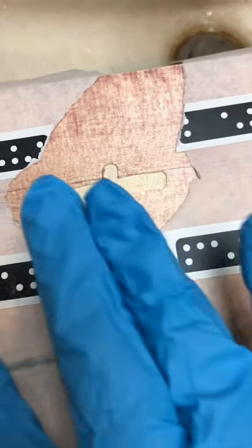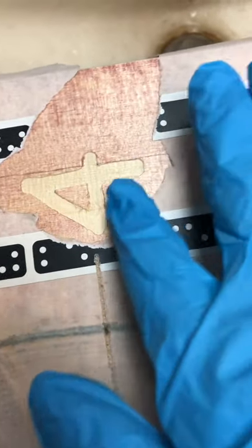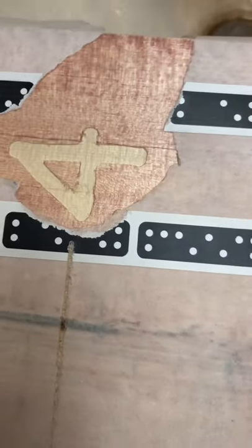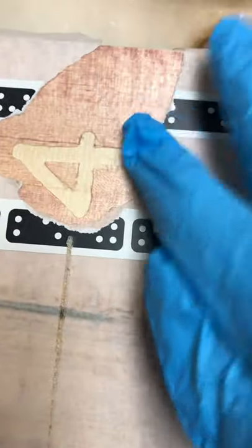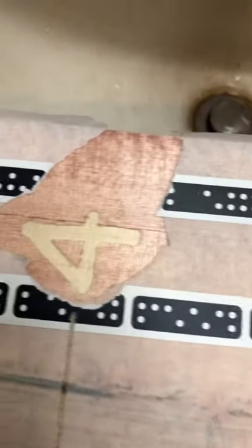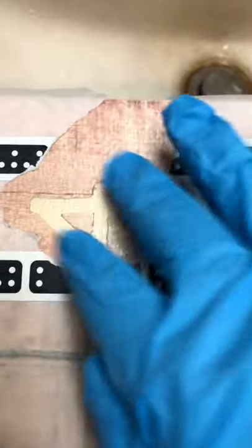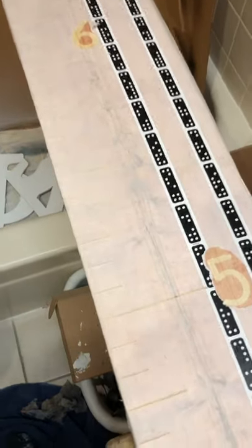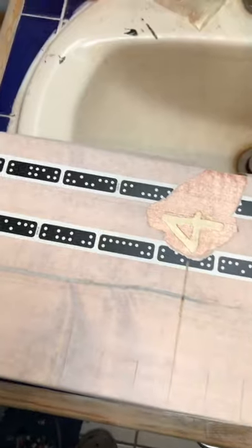But our board that we're going to be putting this on has two very nice soaked-in coats of our oil to give it a really nice shine and sheen and protection, and then we exposed the wood. So I'm hoping that because we have the full coating of the oil, it won't bleed as much and won't soak in the black around the edges. So that's the reason why I masked the board in the first place. I was following the process of what we do when we're lasering, and thought, well, if I mask it, then once it's grooved in, I'll just go over it and stain it and then peel the masking off and we'll be good. So hopefully that will hold true.